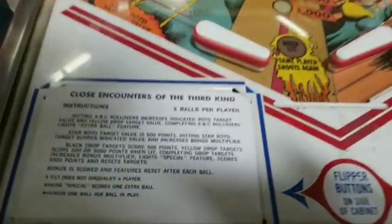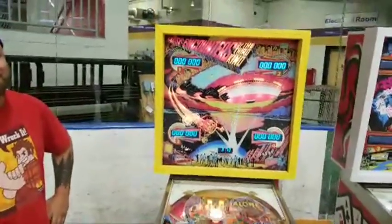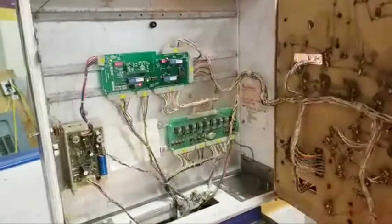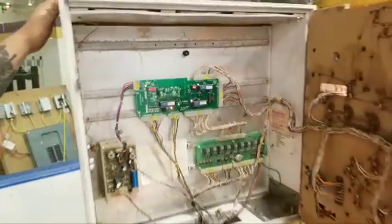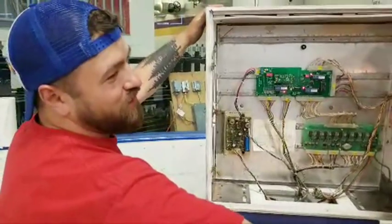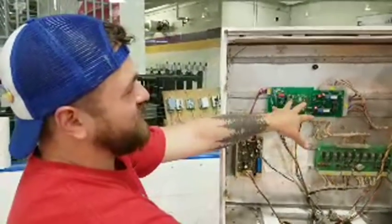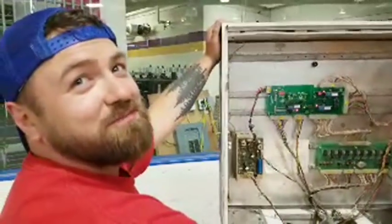What's a little different with this machine — if we open it up — is that inside there is a Raspberry Pi. The original board was essentially non-functional. There are chips from Rockwell called a spider chip, a four-bit chip. There are around eight of them in the machine, but two of them on the original MPU board basically go bad because of over-voltage over time.